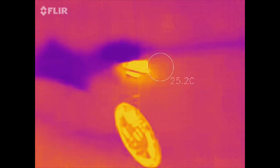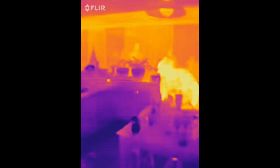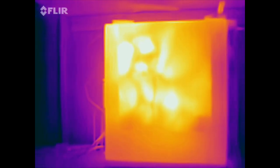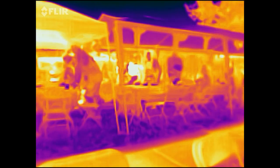I was able to use the camera to find useful things like a water leak in the ceiling. The camera is a lot of fun and allows artsy type photos. The FLIR ONE PRO is excellent at articulating small differences in temperature, which was especially important when measuring temperatures on my plasti-dipped motherboard. The camera worked best when there were big differences in temperature, making it easier to track moving objects with greater contrast. One of the most disappointing aspects of the app is that the settings menu disappears once you start recording, making it impossible to change emissivity settings while recording video. Many users have also reported the app crashes constantly and sometimes doesn't even recognize the camera when it's plugged in, with some users resorting to other applications. The camera and app worked fine with my OnePlus 5, but your mileage may vary.